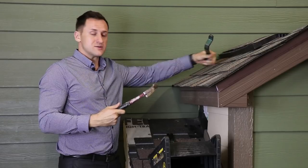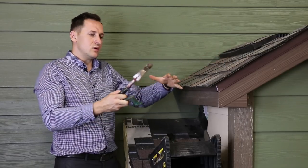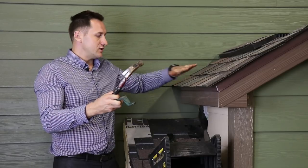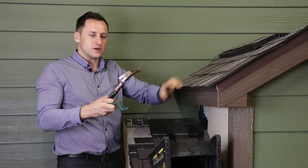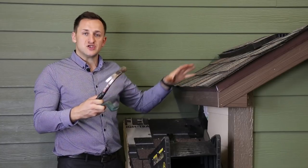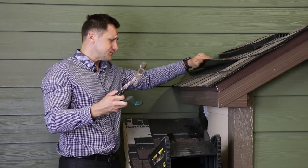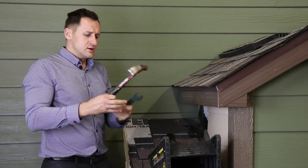The shingle is not damaged and you're not risking damaging it. You also didn't crimp it because you didn't have to lift it all the way up. This is perfect when you work in a small area — maybe you work on flashing where it meets a flat roof, maybe you work around a chimney where you add dormer flashing, or a cricket.